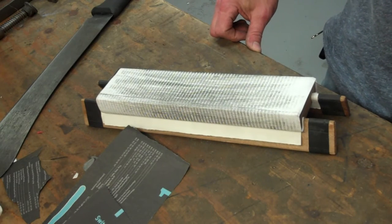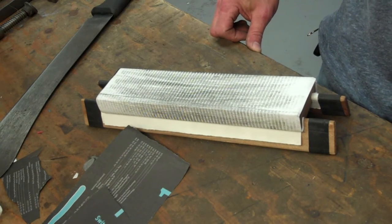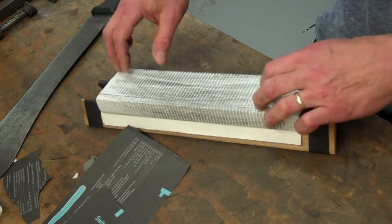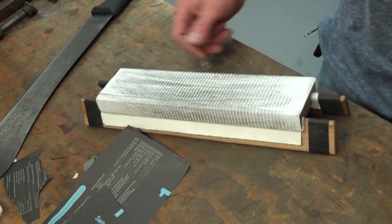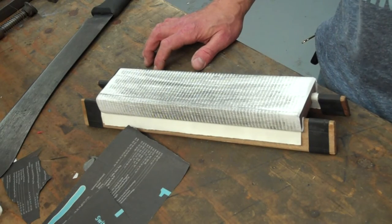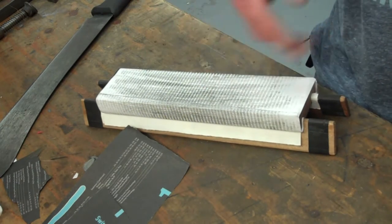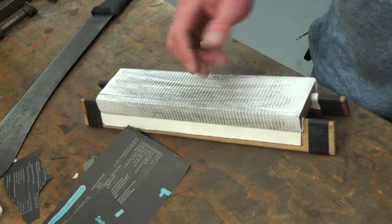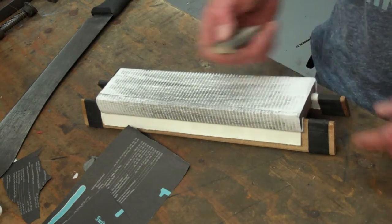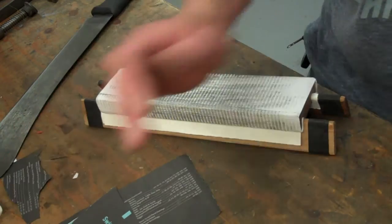All right, well, thanks for watching. That's big tool sharpening on a washboard. You can use the exact same technique on any bench stone. In fact, you can get this right down to a, you know, like a 6-inch stone. It goes a little quicker or a little slower, and you have to stop to clean it off more. That's where a water stone or something comes in handy, but the sandpaper is real forgiving for that too, because you can just clean it off. So it's a good medium for this kind of work.